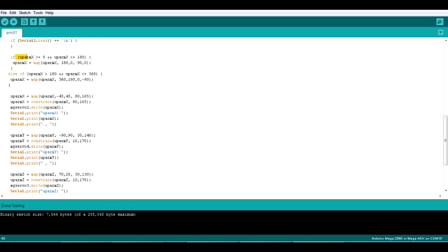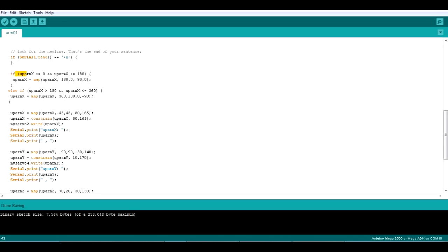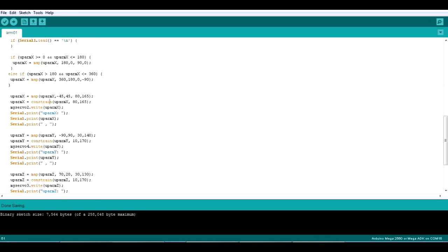X was a bit more complicated, and the reason for that is that when the sensor powers up, it's on sort of a 0/360 point. So in fact, the data that comes out of that is a 0 to 360 rotation. But when you tip from 0 and you keep going down, it flips over to 360, which is quite unhelpful. And that's the point at which it powers up. It's on that point of flipping from 0 to 360. So I've had to use some logic here to turn round that 360, taking the two 180s and reversing them. So in fact it doesn't flip unless I turn it all the way around the other way, and we'll discuss what we can do about that, because of course I might move in space using the prosthetic arm, and we'd need to combine the sensor with the data with the sensor on the body to make up for that. So there's a bit of extra scaling there, but essentially that is then written out to the servo, and that's it.